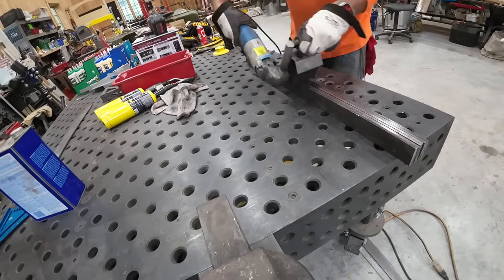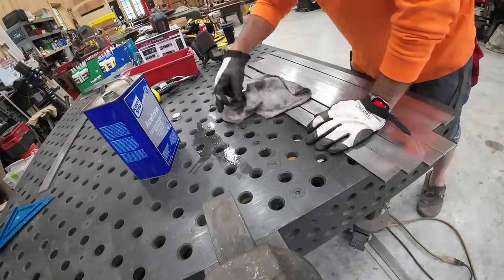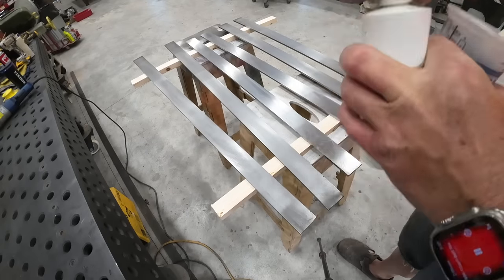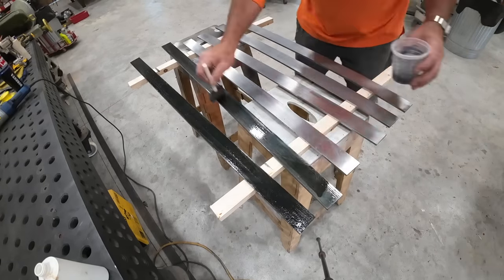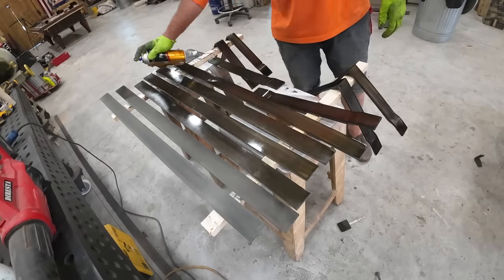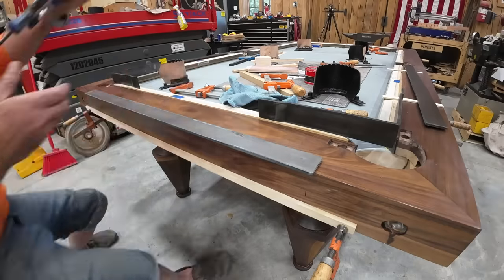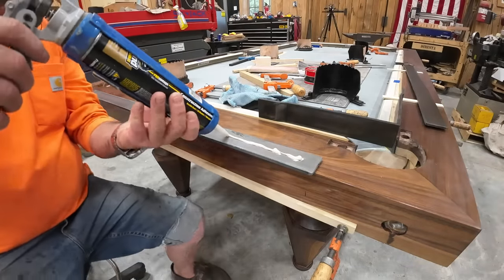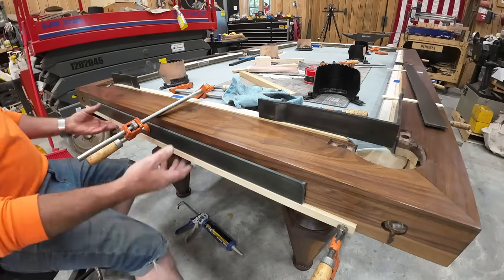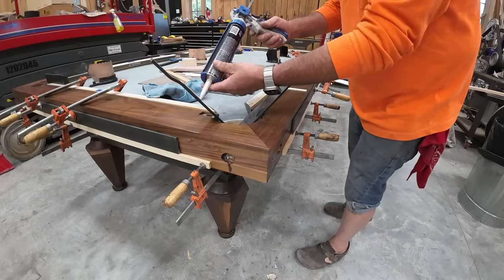These are all the pieces between the corners and the side pockets. If I'm going to blacken them I need to get off all the dirt and grease, otherwise the blackening agent does not work. It's pretty incredible — you spend so much time cleaning, then you see where you haven't cleaned it by putting on the blackening agent. It turns black, then gets a little powdery — I hit it with triple-zero Scotch-Brite, clean it off, and then give it a coat of poly. Here you see me using construction adhesive from Titebond — I glue the steel directly to the wood.